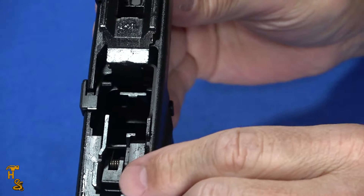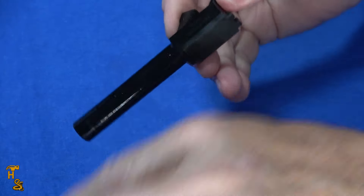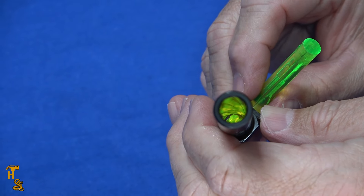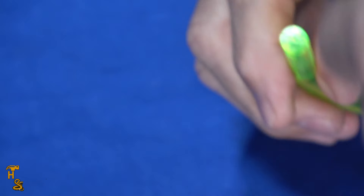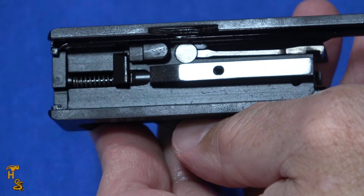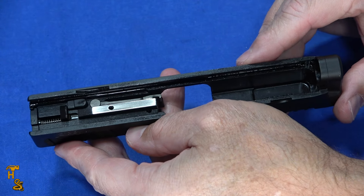Everything is well machined. The fire control group and the sear are in the rear. Looking at the slide, there's a dual recoil spring — a nice solid dual recoil spring. The barrel is well machined with conventional rifling. You can see the rifling is really sharp and crisp, no tool marks, no chatter or anything else. It has a polished feed ramp. These things tend to work — they just eat anything. Everything in the slide is clean and well machined. The drop safety plunger is actuated as you pull the trigger. It's not fancy; there's nothing in here that isn't here just to make it work, but everything that is here is well done and clean.